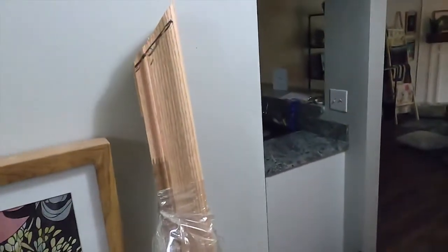Well, this is going to be it today. I've actually made some little notes on here and have got this Newel post. It's really nice. I think we probably got our stair problem taken care of. I'm going to have to come over here with steel wool or something to take the gloss off of that. But we should be good there. I'll fill that in with some colored putty, and then we've got that taken care of. Need to do a little painting, but we'll do some caulking up underneath that, and then also on that end to kind of sand up.